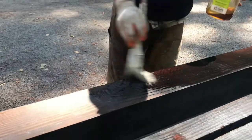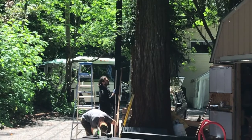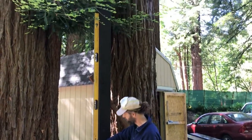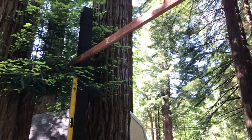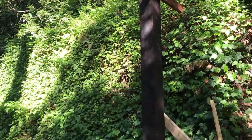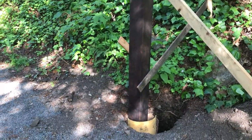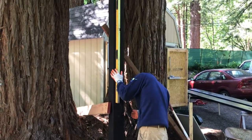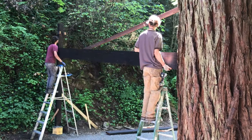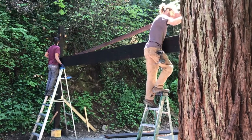We'll do all of these and create a great entryway. These are the posts for our new entryway. The only thing I really want to draw your attention to is the 2x4 that goes across between them — that's screwed on and ensures they're on the right plane with each other when we attach the final header across the top. These are nice and plumb.